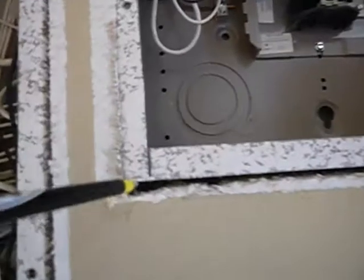And then the cabinets, as they're installed on the walls, they're not supposed to have more than a 1/8 of an inch gap. I'm picky, I know. People pay me because I'm picky. I get it. I've been called worse than picky. Less than 1/8 of an inch gap.